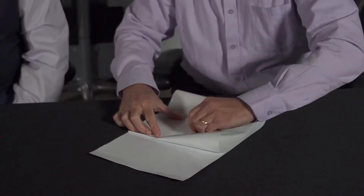What if we did see another cut in that same shape on the second ply and even the third ply? I've seen that many, many times. As Tim said, the problem with that is you're going to be cutting up your cutter protection strip very prematurely. So if we were to see that in this test, we would simply back off — turn the silver component in a counterclockwise direction to retract the blade — then run that test a second time and see if we get a better result, until we get it dialed in.